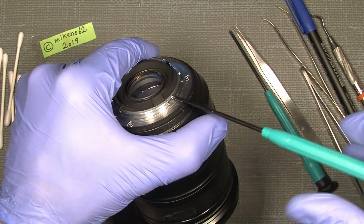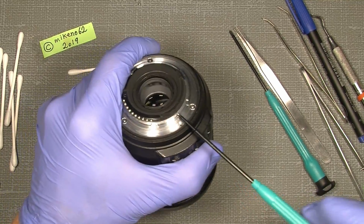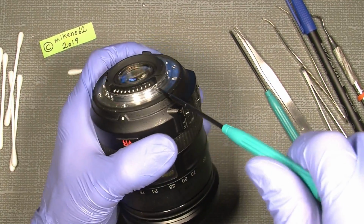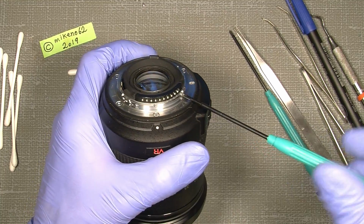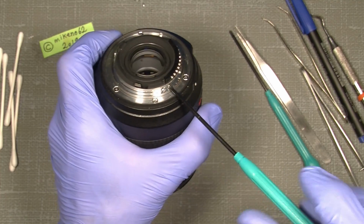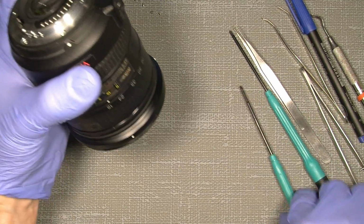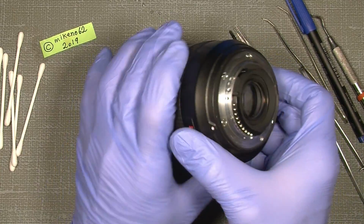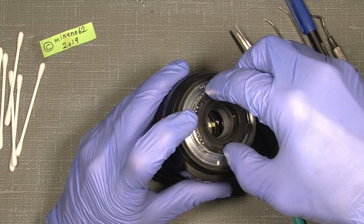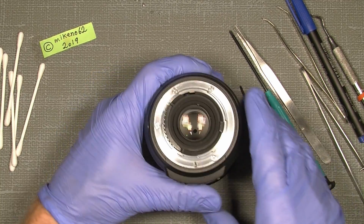And we'll take this screw here and the last one for this ring, and we can just continue with the contact bridge. So there, and the last one. So it's good with a magnetized screwdriver, which will make it much easier to actually unscrew, take the screws out. Take care of the flex cable in here. It's a bit fragile,